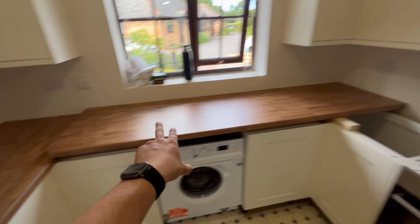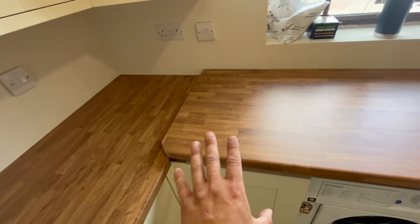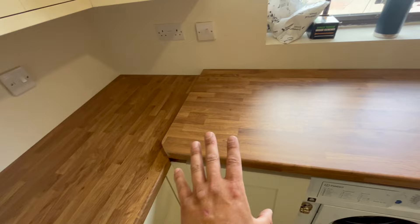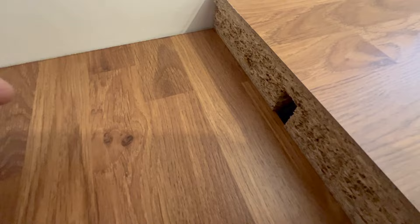As you can see, I'm doing these worktops here — we've got one into the corner and one coming back, and we'll have a return in here. I've just put this one in temporarily to check if it fits, propped up on a piece of wood sitting on the other worktop. This one doesn't actually fit at the moment, but if I show you around this side, there's a nice snug fit with a small gap that'll clamp up lovely.